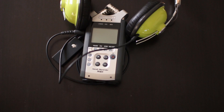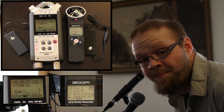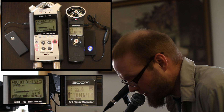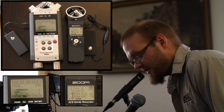By using a Y jack in combination with your Zoom H4, you can monitor audio and send it back to the camera at the same time. Just to give you an idea of what all this means, I've got my recorder set up right here. I've got one mic tied to one channel, so I'm talking into that channel right now. And now I'm talking into the other channel. You can see the audio registers on one channel and not the other channel.